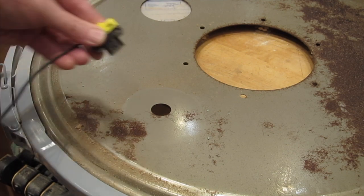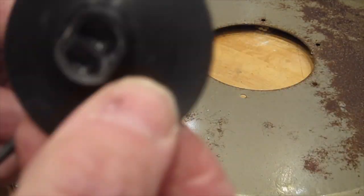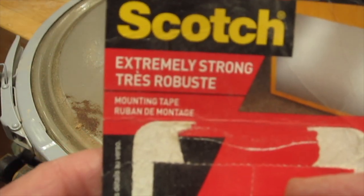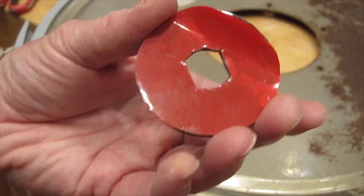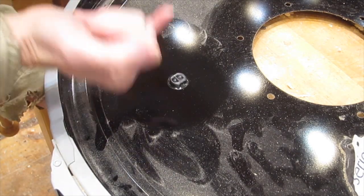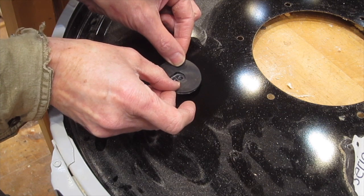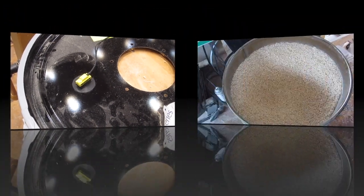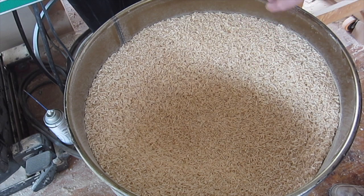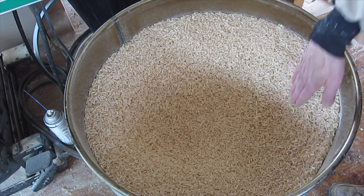They provided a hole in the lid but it's kind of big, so I'm putting neoprene washers — cut to fit the rectangular-round hole of the sensor — on each side, stuck on with Scotch extremely strong mounting tape. I've cleaned all surfaces with methyl hydrate. I used the Banner sensor through the hole as a guide to get orientation and alignment to match the one on the other side. The sawdust has quite a deep profile, and the flattest spot is where the level sensor is located, giving a more predictable reading than if it were hitting a steep angle.